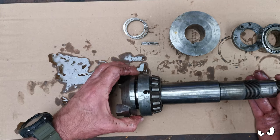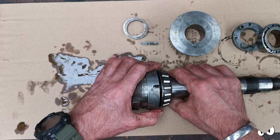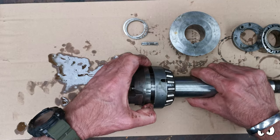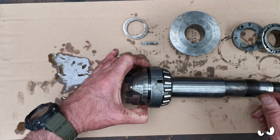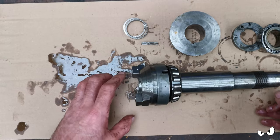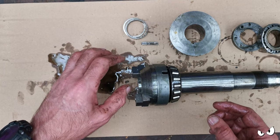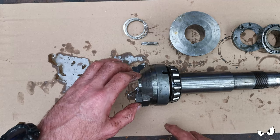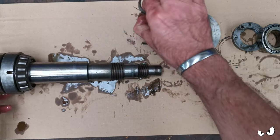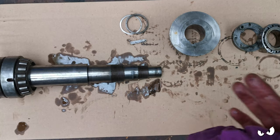This is where it all went a bit pear-shaped I think, and this bearing I think is shot. I don't really care how I get it off but it's coming off. I'll use that puller again and go in there and get the bearing off so I can get a replacement sorted. In the cup that this all goes up in, that's where the race is for this bearing - I might even knock it out and show you, because I'm hoping the new bearing will come with another race as well, in which case I'll need to take that race down to the shop.